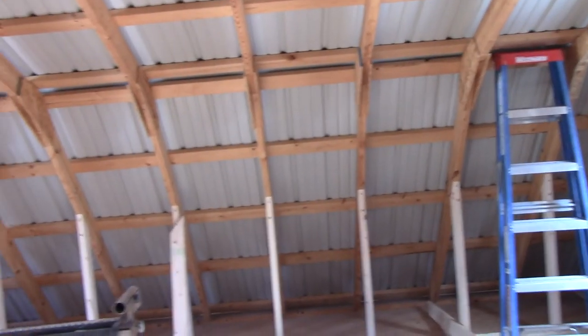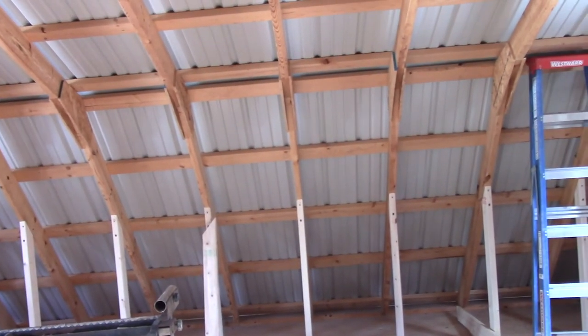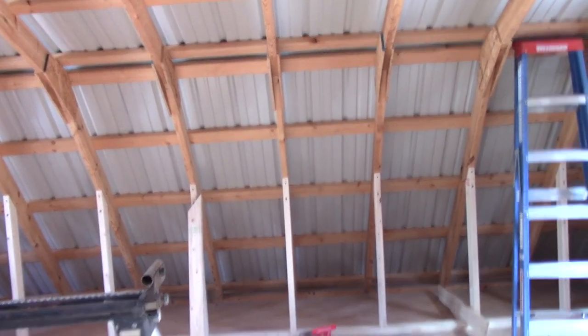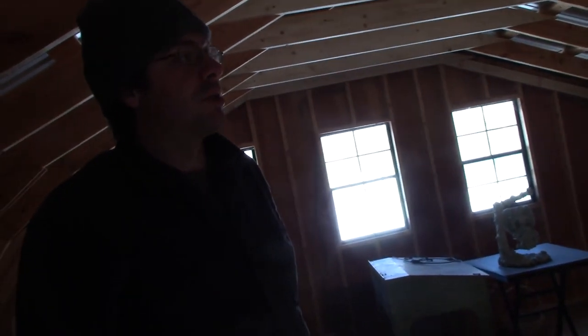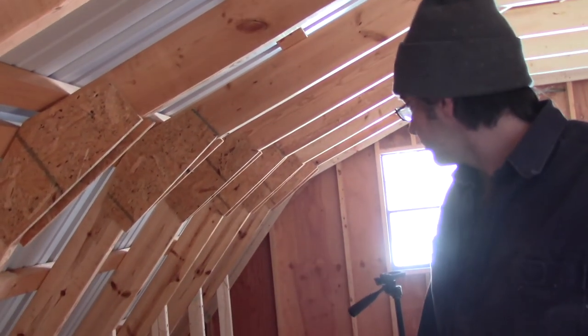Well, that's true, because they're not really carrying the floor. It's like we're building a truss. If it was a truss, you'd be carrying the floor away. Yeah. And this floor is supported from underneath. It is. Like a storage truss isn't. Yeah. Storage truss is just hanging on it. So, we kind of built a hybrid storage truss with the collar ties and the wall sections. So. Yeah. All right, I think we did okay today.